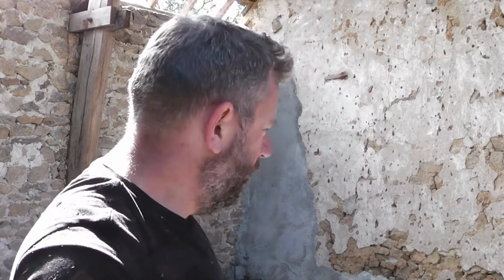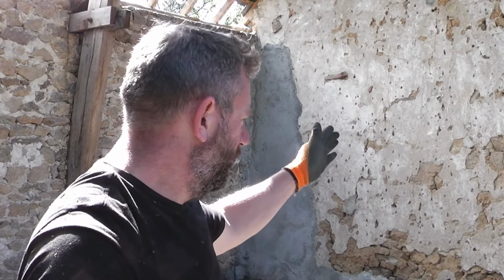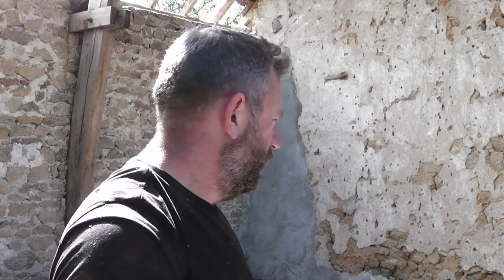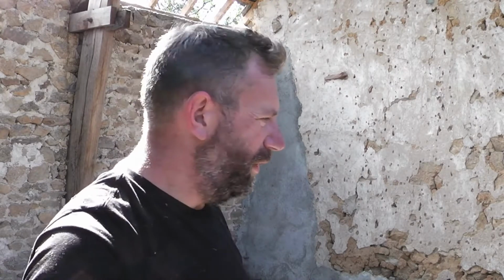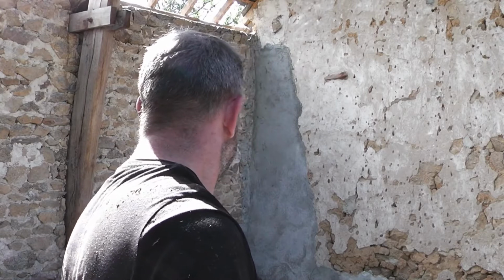Well, that's got the floorboards out, which is good on that end. I'm going to have a good clear up downstairs, all that old floorboard timber and various other rubbish. Clear all that out of there. I'll put the scaffold up, saw through all of those joists, and drop them. Unfortunately, every one of them's got rot. There are a few sections that might be long enough to be worth having, but it's such a shame really, and they're all oak. Oh, they'll burn. Firewood if nothing else.